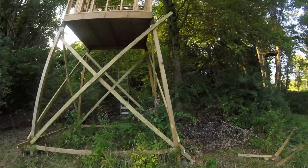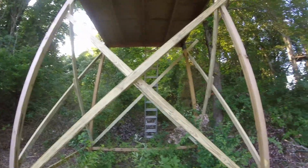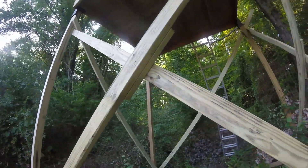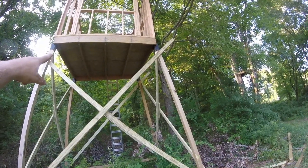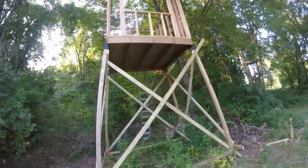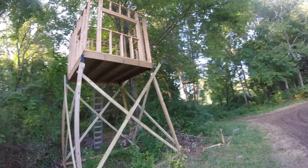I took some pictures — we didn't have cameras set up, there was a lot going on. I changed out all my supports, cut a couple up top, crisscrossed them, and put a 2x4 block in the middle to keep them tight. I needed 16-foot ones for the top and 12-foot ones around the bottom. Then we put three-quarter inch pressure-treated plywood for the base floor, and the walls I had built last year in my shop — we stood them up and got them up there. Now I've got to put on rafters, sheathing, siding, and roofing.